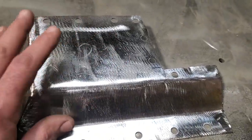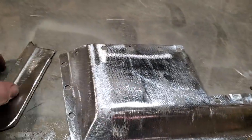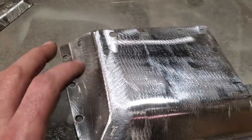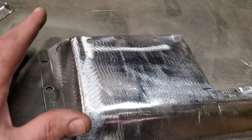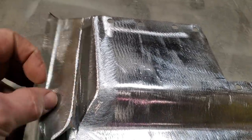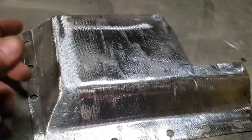This wasn't straightforward and simple because I did foul up the back side here at one point. I made this panel and made the back side, this piece here, which went along here, as you can see, is too short. I made that, and then I had to make another piece to mount up here on the car itself. And when I got that piece welded in, this didn't work, so I had to cut this out of this here, make up a new one, and weld it back in again. So, you know, it's only metal, cut it up. If it don't fit, make it fit, right?